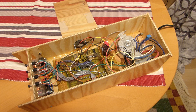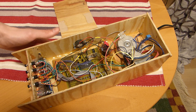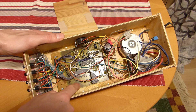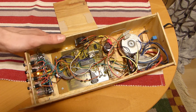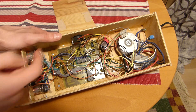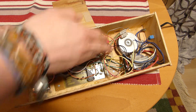Let's have a look inside. At the heart of this is an ATmega8 AVR microcontroller right here. It is driving the Nixies using multiplexing with these 10 transistors here for digit select and 4 transistors here for tube select. The high voltage I get from using 2 transformers back to back — it first gets stepped down to 12 volts or something, and then stepped up again to around 230 volts, and then rectified here.